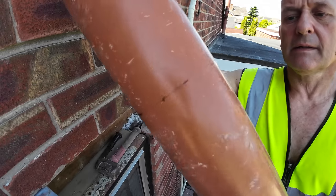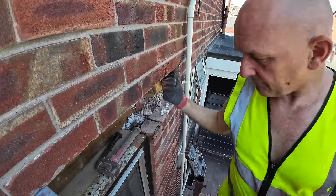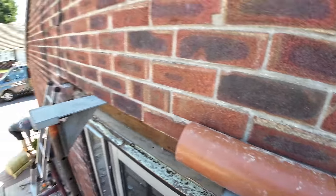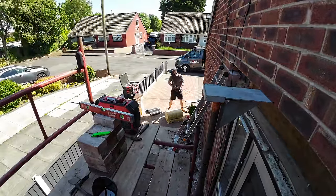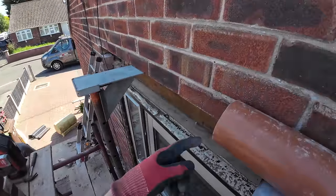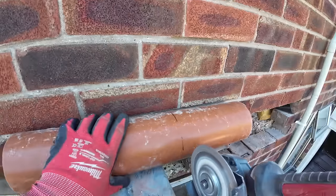So there's our line. We're going to cut it 5mm shorter than that, just to make sure we're not pushing that cover out, because it'll be built in by then. So Alex is going to cut me the 170mm strips of insulation to go behind the lintel. Behind there, and then we'll get the lintel in and start setting the tray.